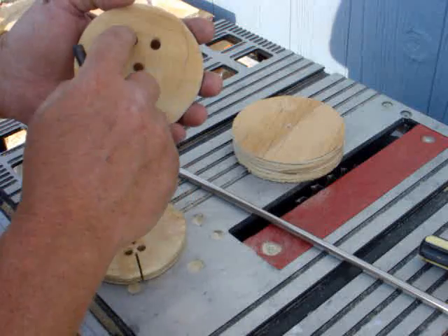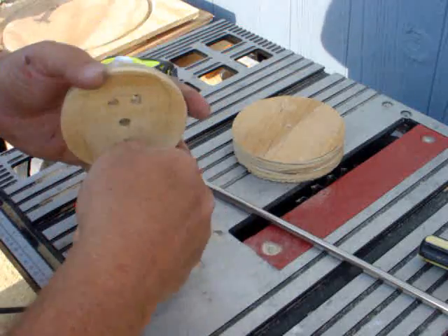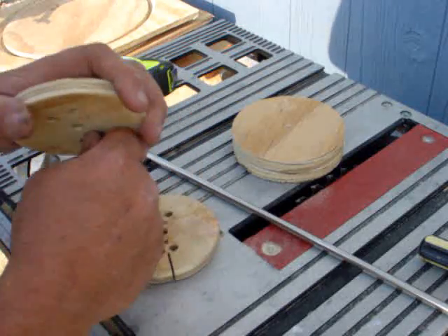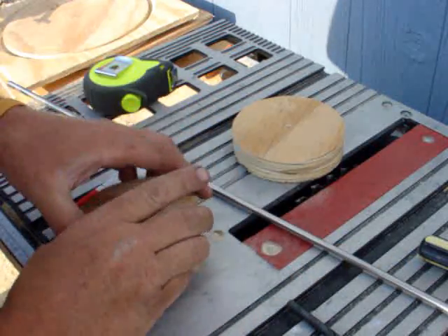Notice the shape of the coil form on the inside. These came out pretty good — these are supposed to be in the corners so that when you go to take your coil off, you put a pin through both sides of your coil winder as you wind it up, and basically when you pull the pins your coil should come loose of the form pretty easily.